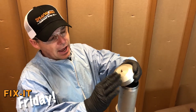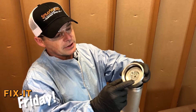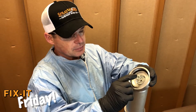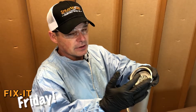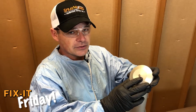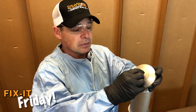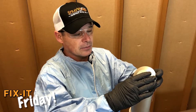Let's dive into the anatomy of the air cap first — there are several pieces that you need to understand. There is a black seal here; they generally don't go bad and don't often require replacement. The spring does get smashed and the bumper underneath can get damaged as well. The screw is actually an exhaust port — many people think that it screws onto the bumper but it in fact does not. It's there for an emergency bleed-off in the event that air gets trapped on the upper section of the air motor.